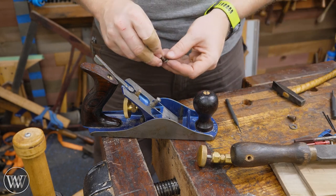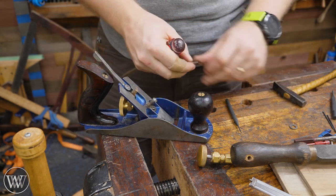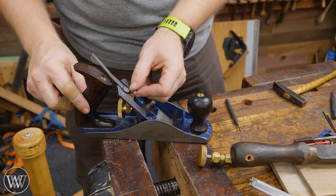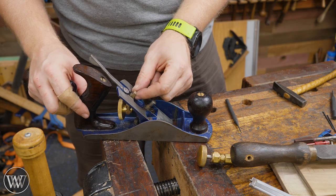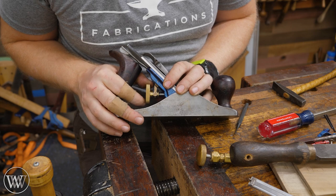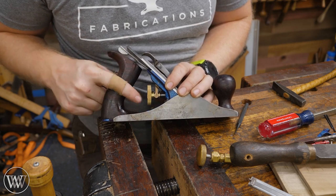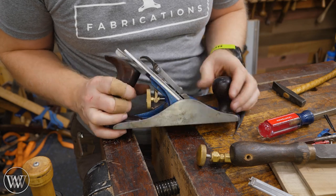With all that done we can put it all back together and check our handiwork. One of the big tricks is to file very slowly and methodically — the slower you file the more accurate you'll be and the more slop you can take out. Now there is almost no slop in this at all; it's really really tight. Beforehand I had four and a half rotations of slop, and now the total slop is about a quarter turn on this nut — so roughly an eighth of a turn on the old nut. Basically no slop at all. Really nice tight fit.